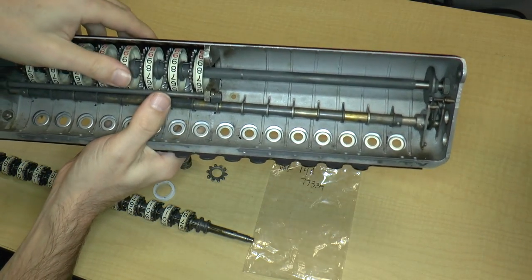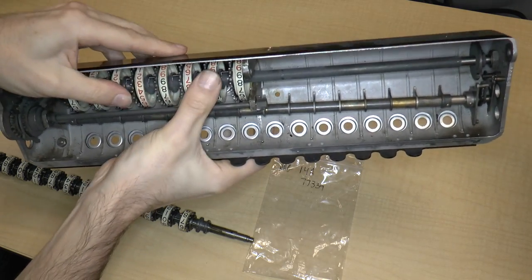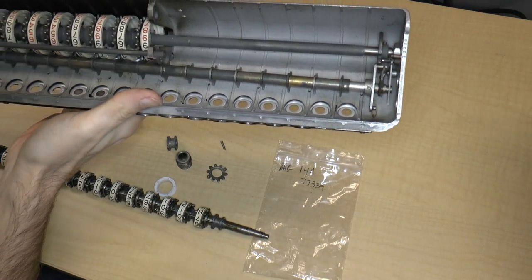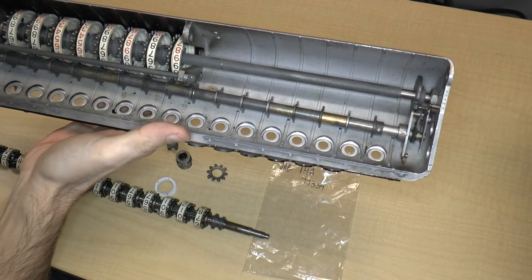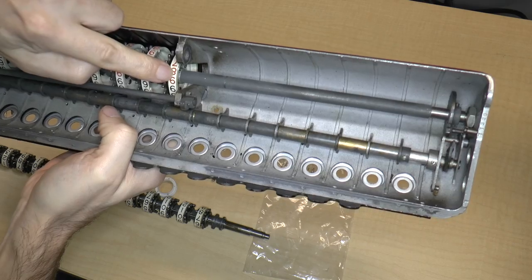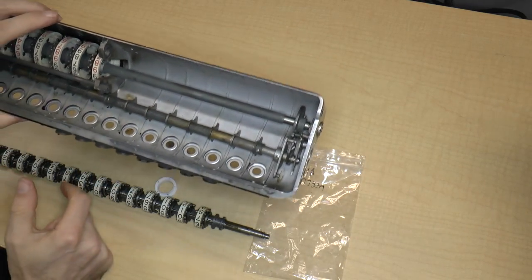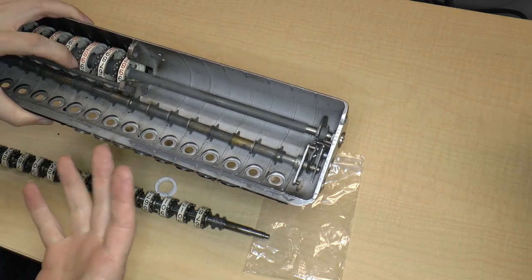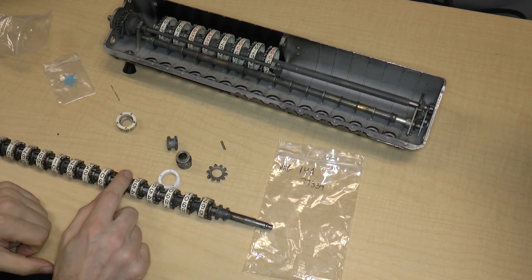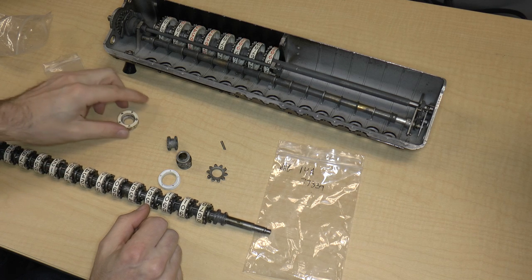The big wheels have the same problem. Once I take apart the small digit shaft, I will have to open this up and take out the large digit shaft, which is a little unfortunate because we've got more taper pins — and you know how much I love taper pins. This is going to be a problem because the digit wheel is right over here and I would have to apply heat right next to it. One thing I've been considering is using that freezing spray to maybe freeze it, then heat it up slightly, not very much, then freeze it again. That might be an alternative. Anyway, that's it for this 14th episode of taking apart the calculator.